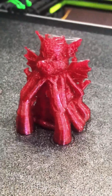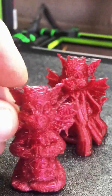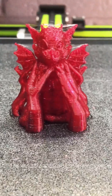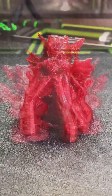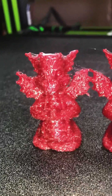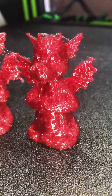There's still a little bit of stringing, which I should probably expect with PETG. For comparison, here's our first print — this one still has the supports on it, so let me pull those off and we'll compare them side by side. Yeah, I'd say there's a pretty vast improvement. This was the original one when the filament was all damp, and this one here is after drying it.